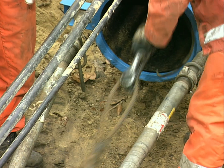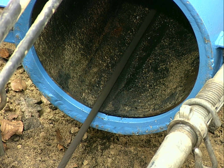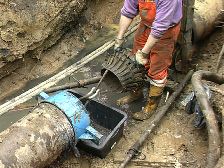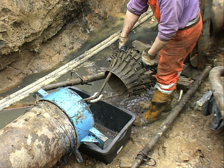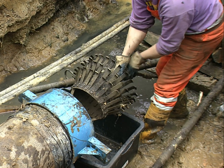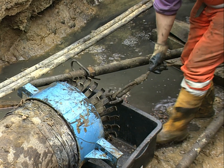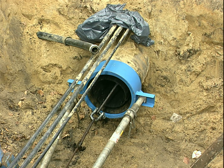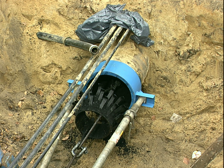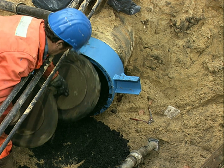A wire rope connected to the nylon rope is pulled through the pipe, starting the mechanical cleaning operation. Cleaning brushes are then pulled through the pipe in order to loosen incrustations, which are subsequently transported to the pipe's end by rubber plungers.